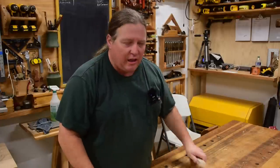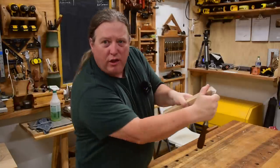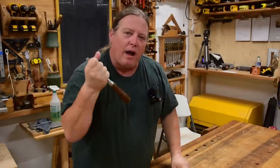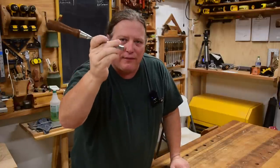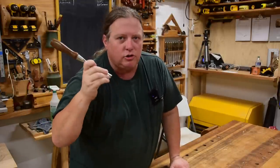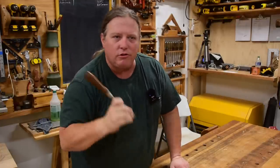If you're using common sense, you know, you're holding a piece of wood down here and you're choking way up on the chisel so that you can add a bevel to it, your thumb's totally out of sight. This is a carving technique. You can do it safely, but I would never teach somebody that who's just starting out. Yes, you can hold it like a knife, like a marking knife, and use it to lay stuff out fairly safely. Once again, I'm not talking to teenagers or brand new woodworkers doing those kind of techniques. There's always exceptions to the rule that you can do safely.